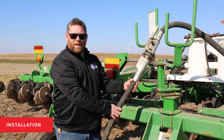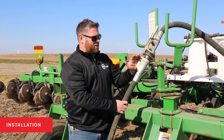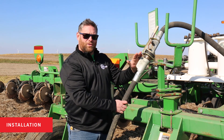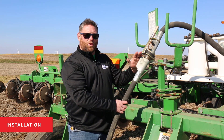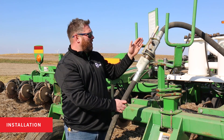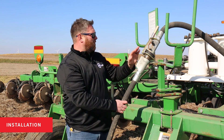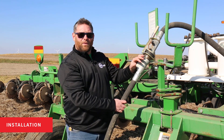We're going to talk about strainers for a minute. Back here between the tank and the Equiflow system, we don't want to put any Y strainers. A Y strainer can reduce your flow by 40% in colder weather and can affect your rates. There is a big strainer already in the towers, and you can put basket strainers on your sections if you want additional straining.